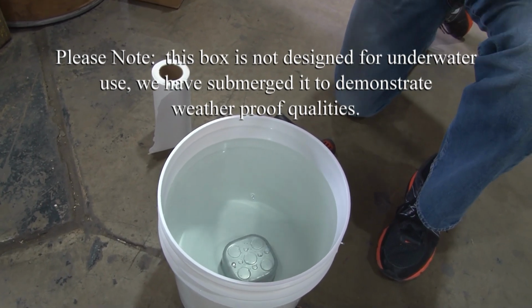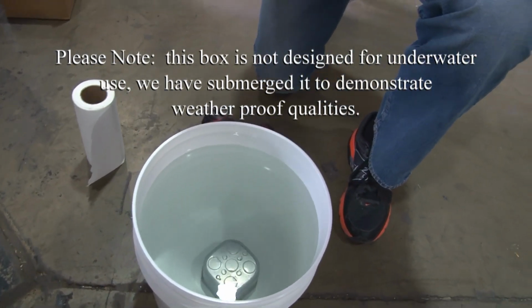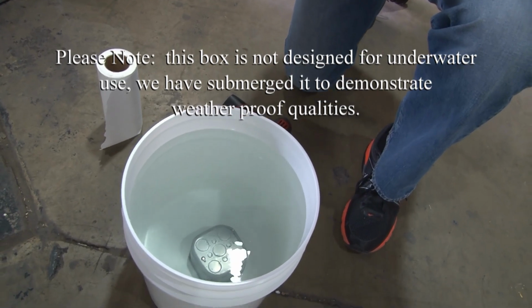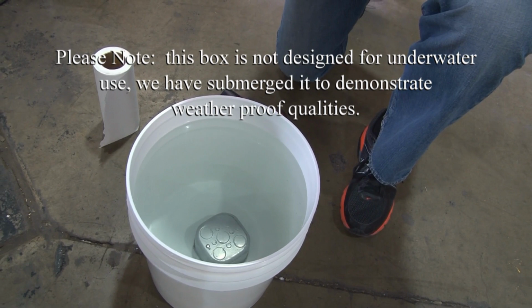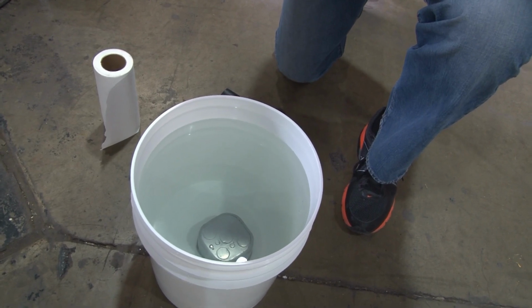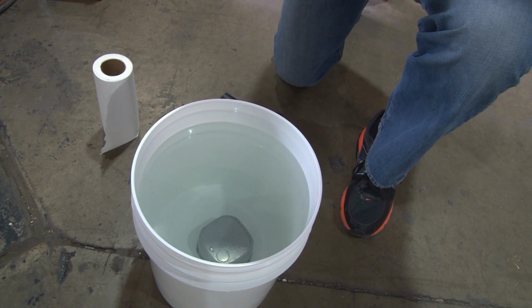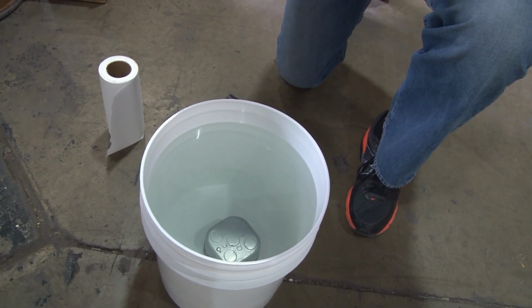Obviously, in most installations, a ceiling fan box is never going to be exposed directly to rain. It's going to be covered with a gazebo, or some type of porch or roof area. But it is important in areas that have really high humidity that a weatherproof fan box is available for purchase. This box comes in 1.5 and 2 1/8 deep styles and has a side mounting bracket, or it comes without a bracket for a direct flush mount stud to the top of the ceiling.